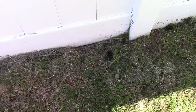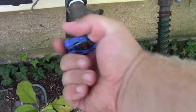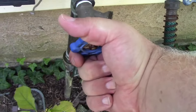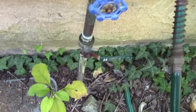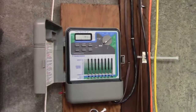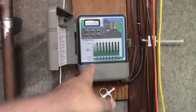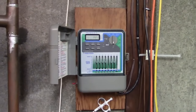Now let's go ahead and close up the sprinklers. I've taken the air hose off and closed this valve over here. And I have this valve here also — just shut that off for completeness. Back inside, shut off zone seven. Now you can turn your main dial to off — I've got to go all the way around. I'm going to reset this how it was so I don't forget in the spring. That's all reset — we're ready to go for the spring. Close that up, but the job's not over.